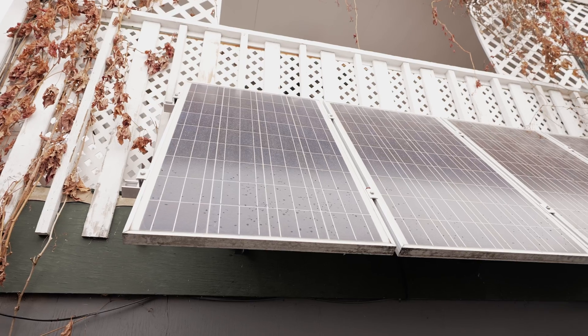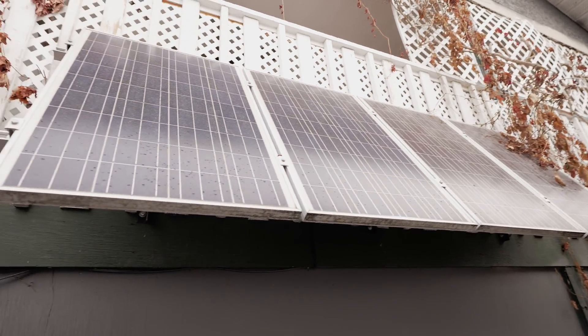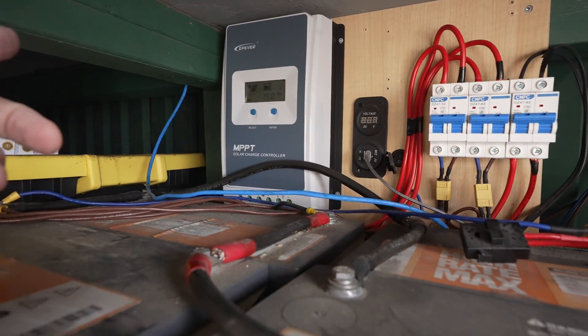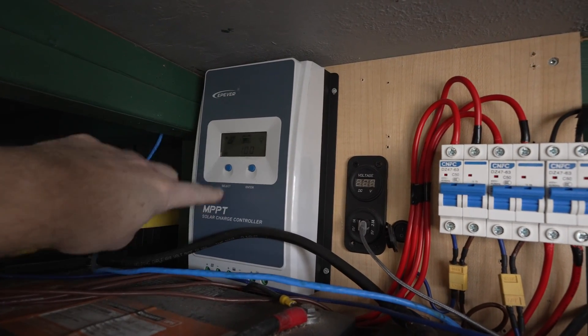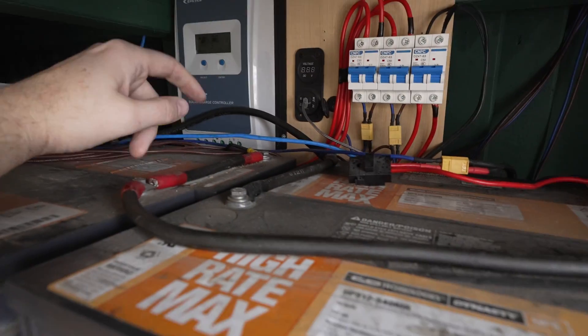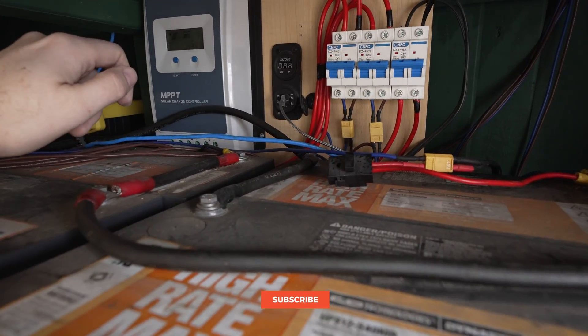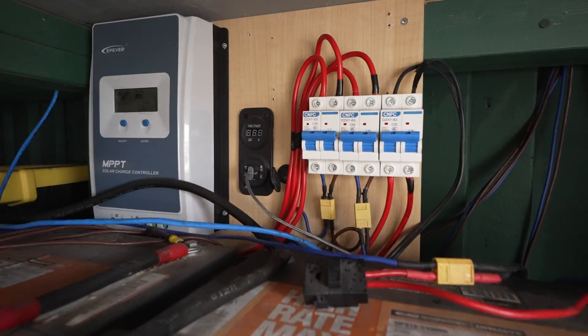I do have a lead acid battery bank on there now but it is extremely old — I'm surprised it's still working, probably at much reduced capacity, but this is a good excuse to upgrade it. As a bit of an update, this is a project I did many years ago: I got four 100-watt panels on the side of my deck that wrap around into my solar charging station area. All of them feed into an MPPT controller. Lead acid batteries charge at a lower voltage than lithium, so I'll need a higher voltage for lithium. I think I'll just take one or two panels and use that to keep the lithium iron phosphate one topped off.